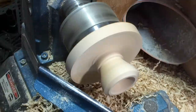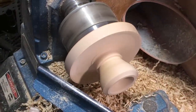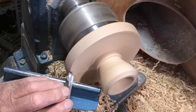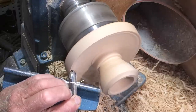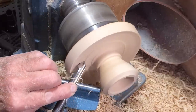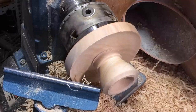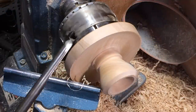Right, it's over there. Now I want to take a shear cut in here. Still using the half inch spindle gouge. How that looks. Almost looks sandable. A little bit of picked out grain there,